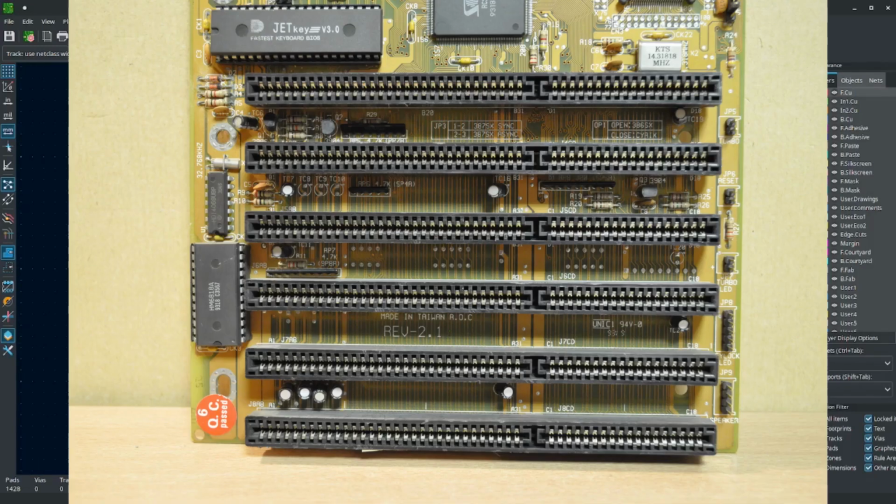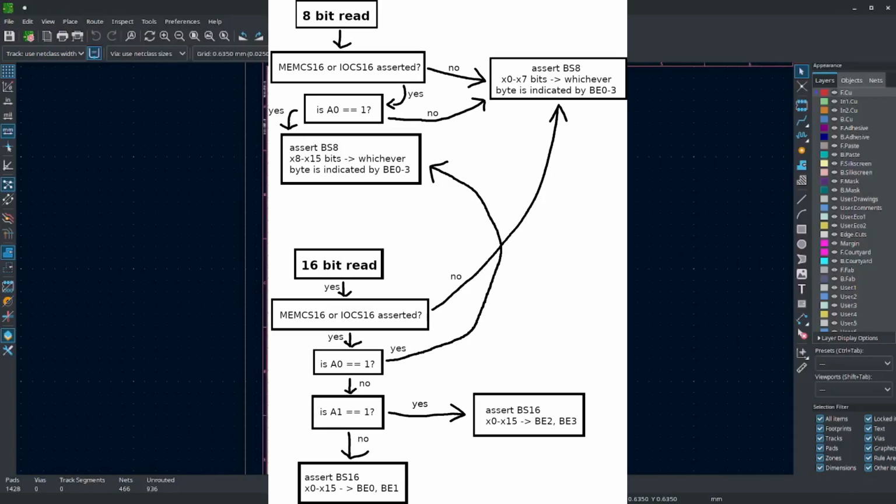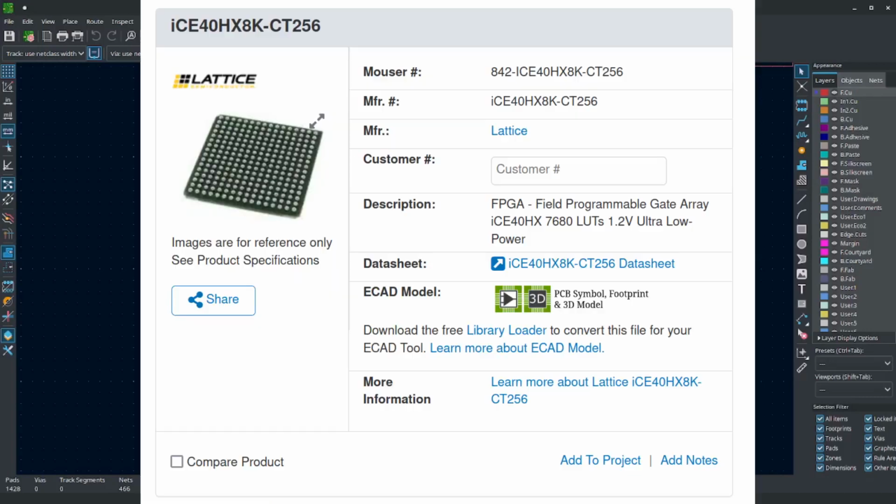Mainly what I'm waiting for is I need to get ISA working, industry standard architecture, the 16-bit expansion slots. 16-bit expansion slots are kind of complicated, and there's a lot of pins on it. There's 98 pins, and they all have to have their own voltage transceivers and all this stuff. So the only way for me to do that is with a second FPGA, because the ones I work with only have 144 pins. I am aware that they make BGA ice40 chips that have up to 256 pins, but BGA components are just too hard to solder, so I'd rather not use them.